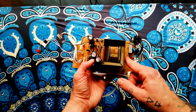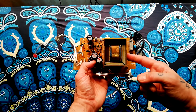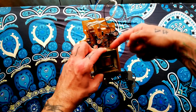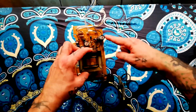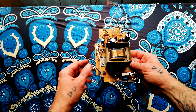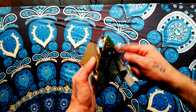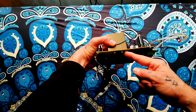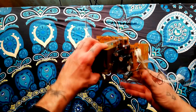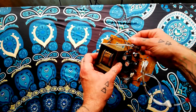The 464 also had an internal transformer, but if you look at a freeze frame in any of the videos I've done opening that unit up, you'll see that the transformer is attached sideways and fixed to a stiff metal plate, which is attached by four quite widely distributed screws to the bottom of the plastic case. Although there is a circuit board into which the pins of the primary and secondary transformers are mounted, that PCB is oriented sideways, so any stress the 464 receives isn't really transferred in any significant way to the printed circuit board.